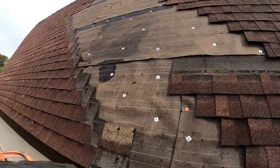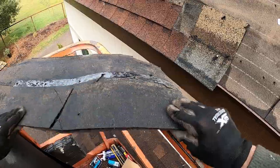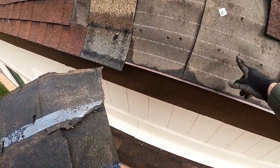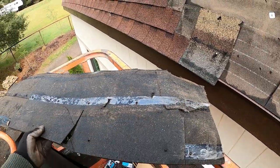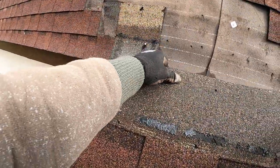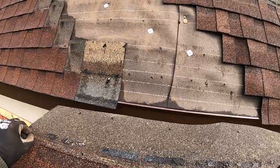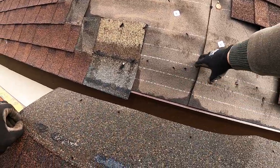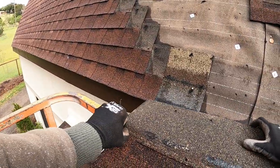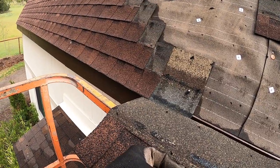As you can see, we got everything dialed in. So we're gonna start laying some shingles on. I have the original double shingle for the first layer right here. And we can start to see what went wrong, because these initial shingles, and as I already mentioned a couple times, this roof has been initially roofed, or it's re-roofed, I guess I should say. So there is an asphalt shingle layer underneath this tar paper. And if you take a look here, here's one of the original nails. That's short.